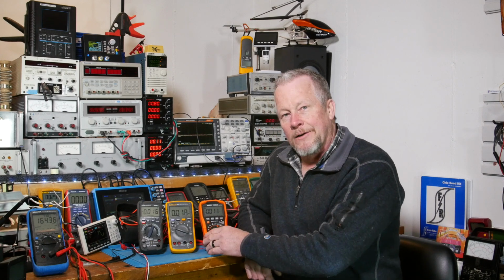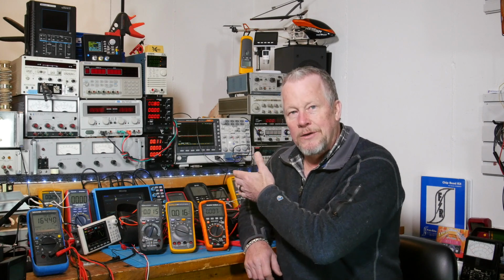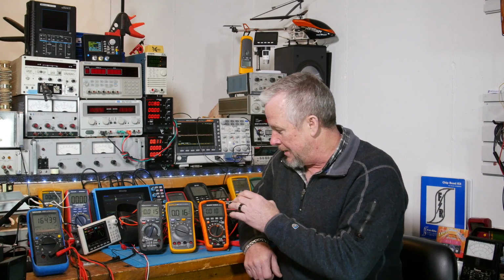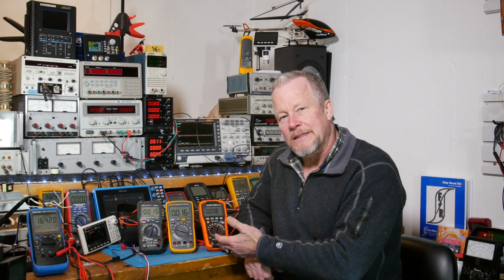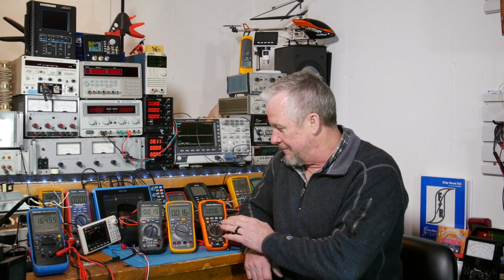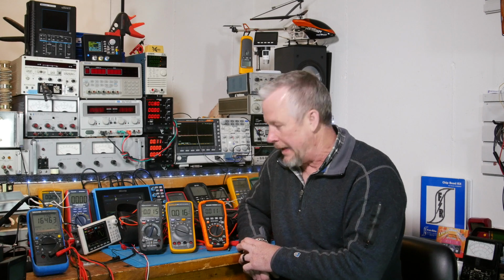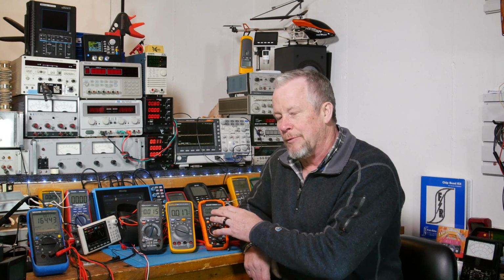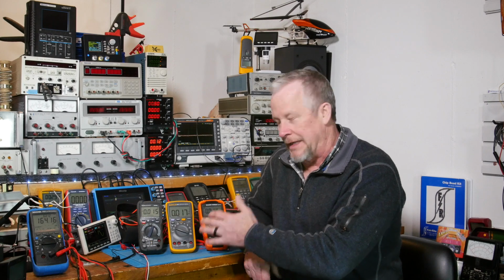It's a nice meter to use outdoors or, you know, to do your electrical work, but also if you do indoor work, like electronics work on a bench, because it has all the features for that as well. But that low Z setting, for the ghost voltages, I mean, putting the impedance on the wire to get rid of that ghost voltage to see that there really isn't any voltage there, that's a thing that electricians would use, where on the bench you wouldn't probably have a use for that. So it does go to capacitors up to 4,000 microfarads. But what's nice is it goes down to low capacitors too, so in the hundreds of picofarads, so that's nice too.